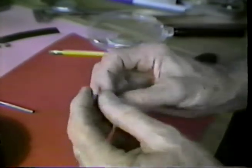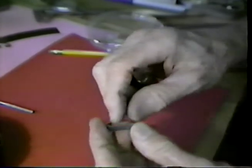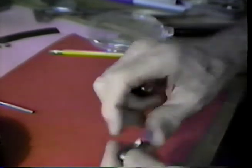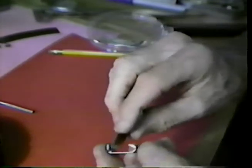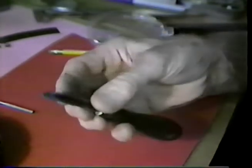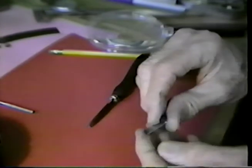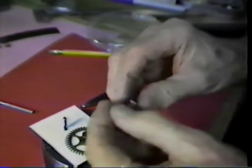Well, a few moments got to being several minutes there. I found that I had painted myself into a corner. The vise that I hold this type of thing in fastens on the bench right where I'm working, and I didn't have anything to hold the piece to saw it. The thing I'm doing here right at the moment, I have a little three-cornered scraper. This is a deburring tool, and I'm scraping the edges of this to get all the burrs off.